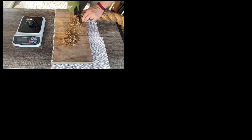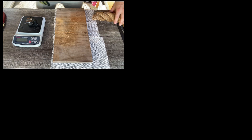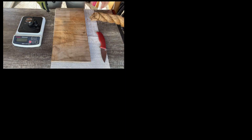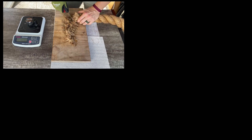An excellent result from all three of these steels. M398 overall takes the second highest reading ever — under 40 cuts, that was done by the Blank Blades 10V blade at 66.5 HRC. So 40 cuts on the 10V, M398 sitting second highest at 30 cuts, Vanex sitting in third place, the Spy27 as the fourth highest reading, and the XHP tied for the fifth highest reading. Very, very good results for these stainless steels from Spyderco.